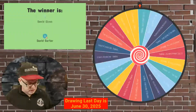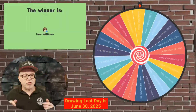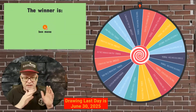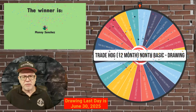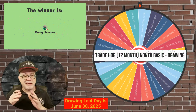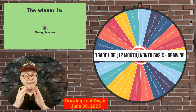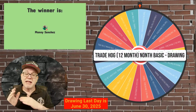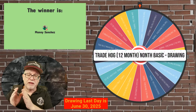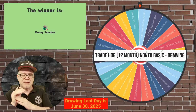Remember, hashtag win, get you in. I appreciate you joining today. Hopefully I didn't go over the ampacity too quickly. Just remember, for most all cases, when it comes to trays, when it comes to cables, use 310.16 and you'll be okay. When it comes to single-insulated conductors or single-conductor cables used in a cable tray, you're allowed to use 310.17, but you have some reductions that you have to follow, percentages, that type of thing. And you get to ignore 310.15(C)(1). If you choose not to use the allowances in there, and you're using the ampacities in 310.16, then you have to follow the rules in 310.16 for that as well.